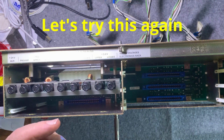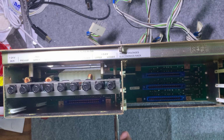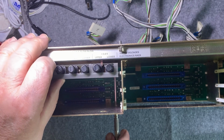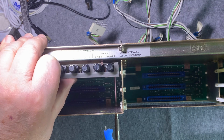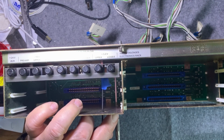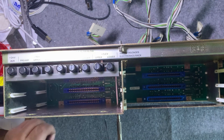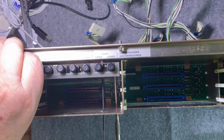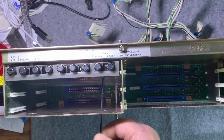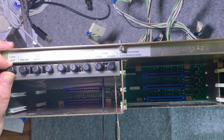All right, to put this board in now, what I've done is I've taped a screw, Belleville washer, and flat washer to the hex wrench. I've put the awl through the hole, through the plastic, into the standoff, and that's now aligning that bottom one perfectly. So this one's going to come in through the top, go in there, and should be able to start our screw and take our tape off. There we go. And hopefully with one in, it'll get a little easier, but I can't promise. I can see that drops down a little bit.